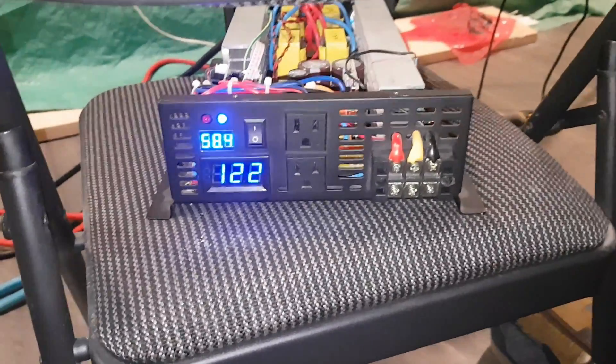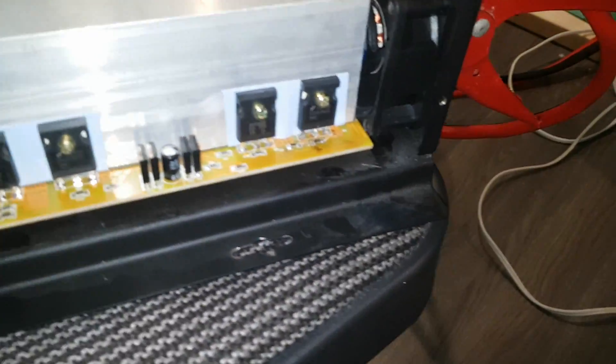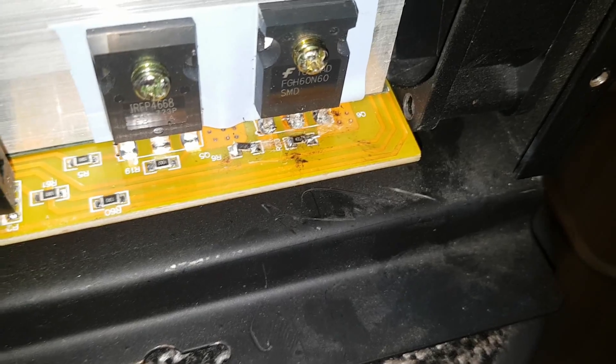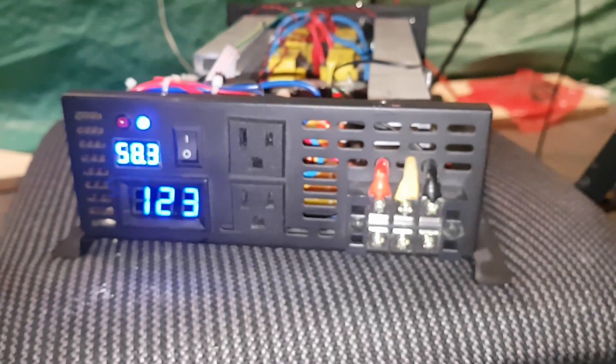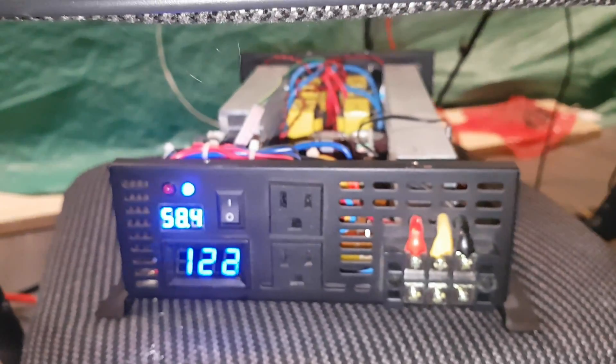She's working. We got the MOSFET replaced and I replaced both those tiny little diodes. Seems to be working. Pretty happy — I'm just missing a fuse right there that I need to put in. Other than that, it looks like we've got a working inverter, and maybe upgraded. Next up: put the case on and do a load test.